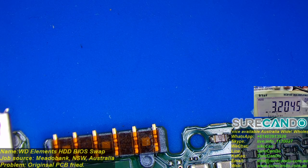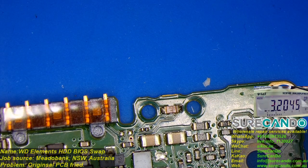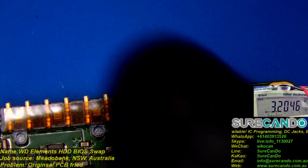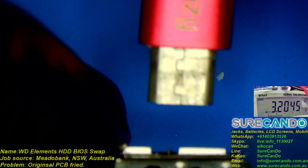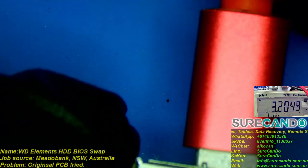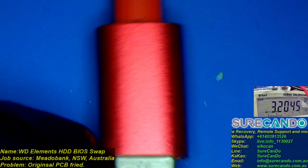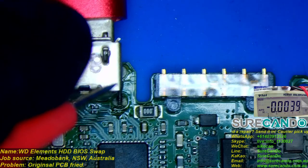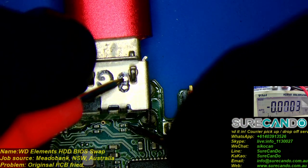You know, we're going beyond what the client wanted, because I feel like just swapping the board out, the BIOS chip may not help it. Okay, I'm just going to connect the micro USB port here, power, and I want to see what happens to my power system. See if it shorts out. No. So my power supply hasn't cut the power, which is good. So that's in, there's no short on the power line. So maybe somewhere here we got power, I'm not sure.